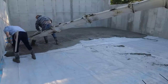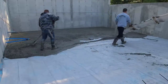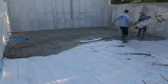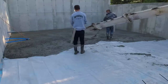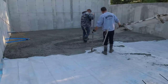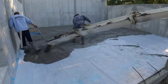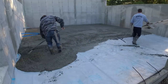We tell the concrete driver to mix it to about a six to six-and-a-half inch slump — that's a pretty good consistency for two or three guys to pour. We've got two trucks showing up: the first one will probably do about two-thirds because the back is about four inches thick and the front is about six inches. We generally like to just dump the first truck right out, though if you've never done this before you might not want to dump the whole truck at once.